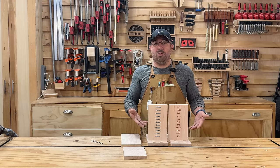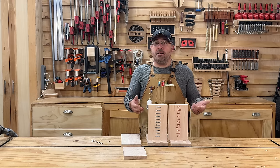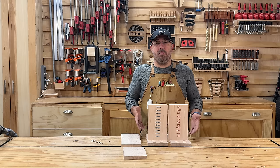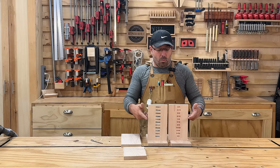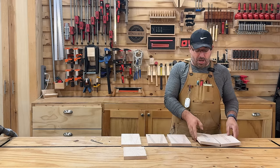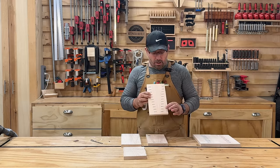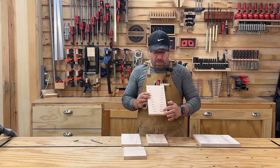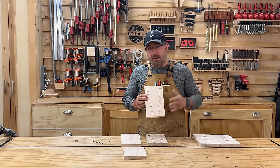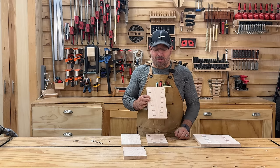Sanding's done — I think it looks pretty good. I've corrected my 7-16ths mistake from my old one. The next step if I'm going with the CNC route is to take these over to the table saw and cut them. What I'm going to do to decide on how to cut is take a pair of calipers and measure the gap in between the magnets, and that's what my overall cut needs to be for each one.